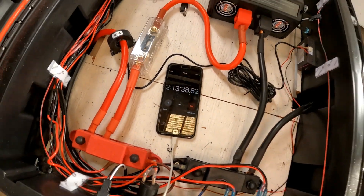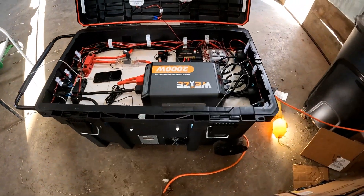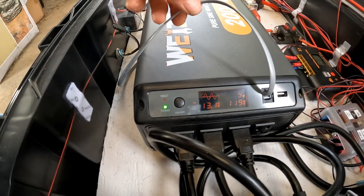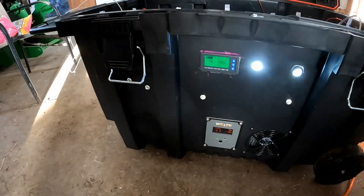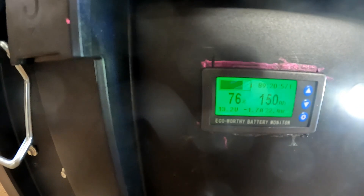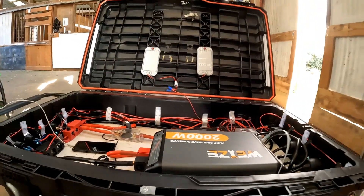The stopwatch says two hours and 13 minutes — it was four hours and some odd minutes but I had some technical difficulties and it stopped when I didn't want it to. As you can see now we're just using nine watts, so the refrigerators are off. When it was up at 260 that was probably the refrigerators doing their defrost cycle. Now we're at 76 percent and the meter says nine hours — or now it says 89 hours — meaning we're barely burning anything. We've got 150 amp-hours remaining, burning about 22.4 watts.